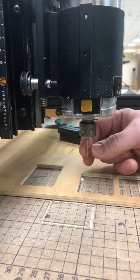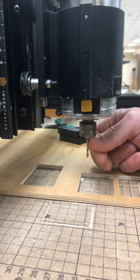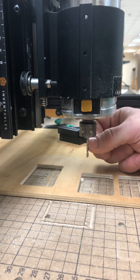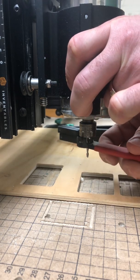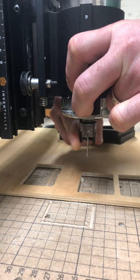Make sure that you're not hitting any of the flutes. You want the round shank of the bit to be slightly protruding from the collet — you don't want any of the flutes or cutting edges up inside. Then hold the yellow button and put the wrench back on to tighten.